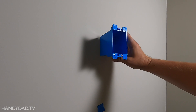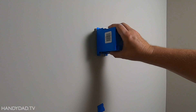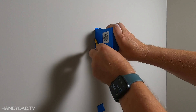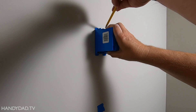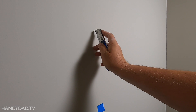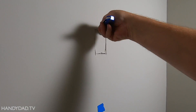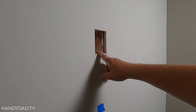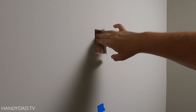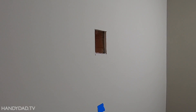Now for here, I'm going to use an old work box. I've marked the bottom and the center, and I'm just going to hold it here, level it, and then mark it. And to minimize the mess, I'm just going to use a utility knife to cut this out. Not only does it minimize the mess, but it also prevents me from ever digging into any wires or pipes that might be in the wall. That's what I was feeling for, to make sure there was nothing in the wall there — and there isn't.